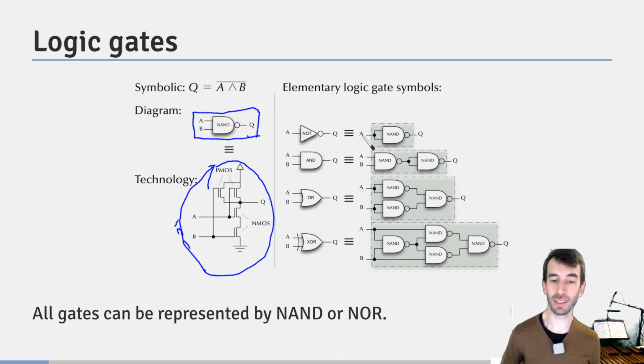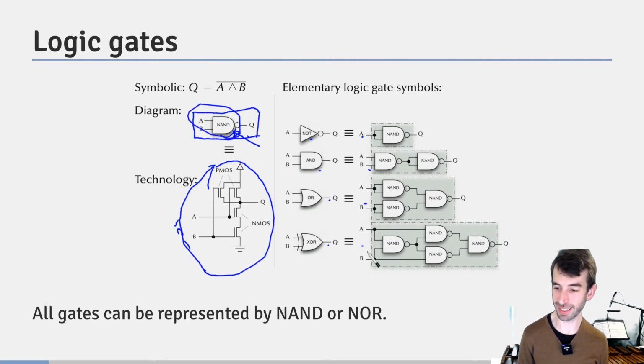And we had a little demonstration of how then once you have one kind of gate, the special universal gate, the NAND gate, you can then create all the other logic gates which you need: AND, NOT, OR, and XOR. So that means that you can create a whole CPU with just one kind of gate. You don't need the other kind of gate.